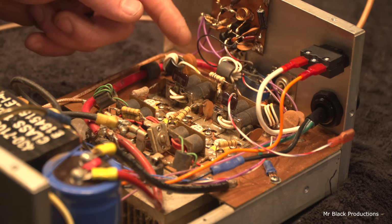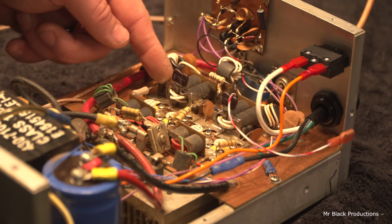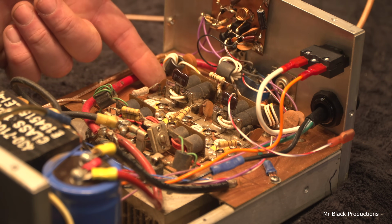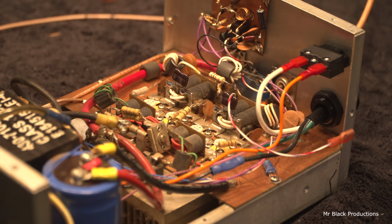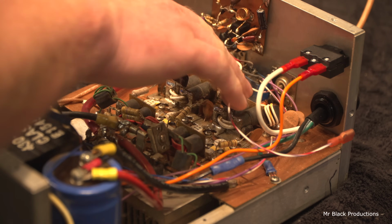these transformers at this size, with this number of turns, at this size of wire, with this amount of surface area on the transformers, should be closer to the 800 department, or possibly even as low as 640, taking into account we're running SD1446s and we got 330 pF capacitors on the side of each one of the transformers. The circuit makes a little bit more sense to me that way. But we've got good input SWR, and the circuit's running stably. These capacitors aren't getting too hot.